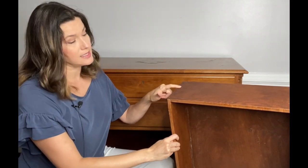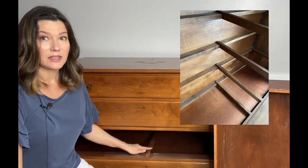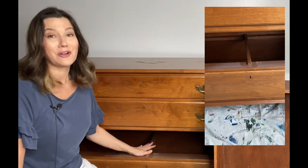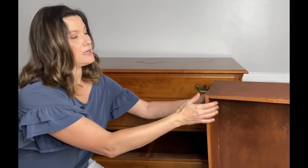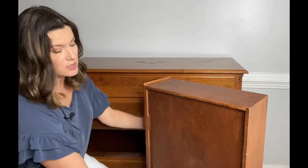So I'm at the store, I pull the drawer out, I can see these beautiful dovetails. I'm going to look inside — I want to take the drawer entirely out and look inside the piece. Inside this piece there are wood tracks, and all of the tracks are intact, which means the drawers open easily, close easily, and they're all there. I don't have to replace anything. These wood guides, along with the back of the dresser drawers, are going to tell you that this is a high-quality wood piece.